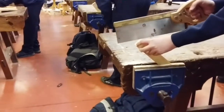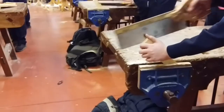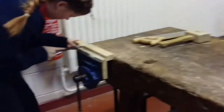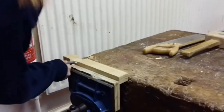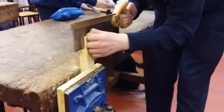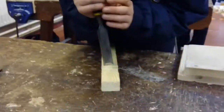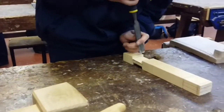We can see the students here having a go at it themselves. A short stroke in the saw should be adjusted, and the hand should be adjusted as well, which is corrected there now — finger along the side. Still some of the other skills being carried out: both hands behind the cutting edge of the chisel, piece secure in the vise. Another bit of sawing along the grain, checking both sides of the line. Then cleaning of the shoulders as well, where the thumb is on top of the chisel and both hands are behind the cutting edge.